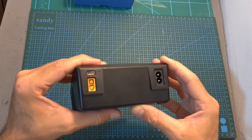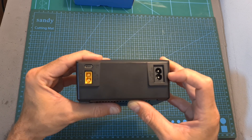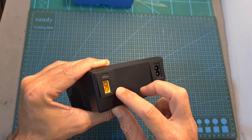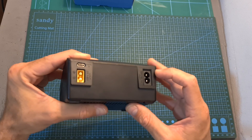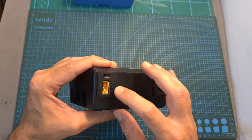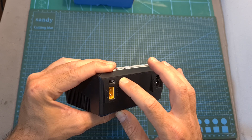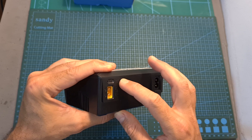In terms of features and specs, on the back side of the charger you can find both AC and XT60 DC inputs. On DC the operating voltage is between 7 and 28 volts, and on AC 100 to 240 volts. Next to the XT60 battery connector you can find a USB Type-C connector that will enable you to charge your mobile devices and update the firmware of the charger.